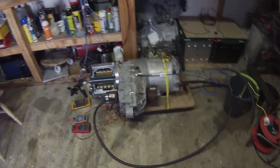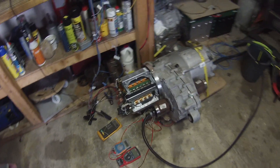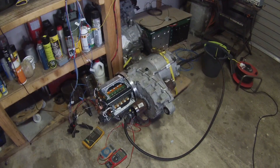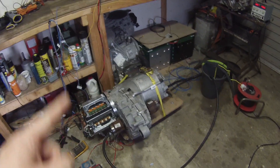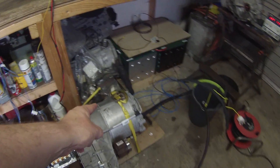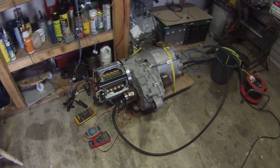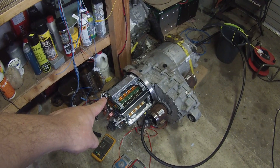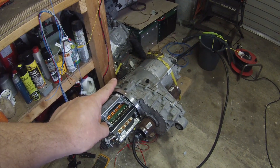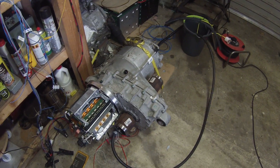What did happen is I got an anonymous tip from a very nice chap who asked to remain anonymous about the temperature resistance curves for the internal sensors buried inside the motor windings — brilliant. But the problem is we don't have any data for the sensors used for the IGBT heat sinks, or the ones used for the case of the motor — probably oil temperature sensors, that kind of thing.